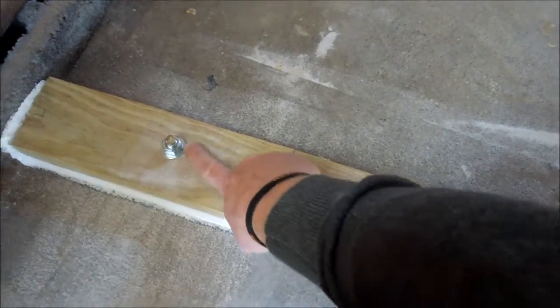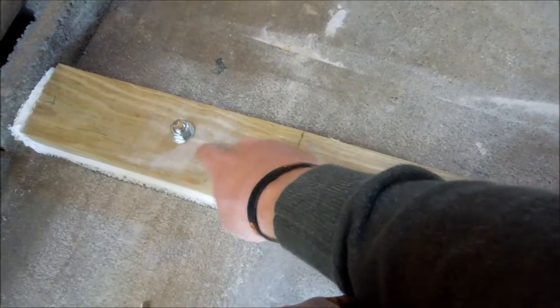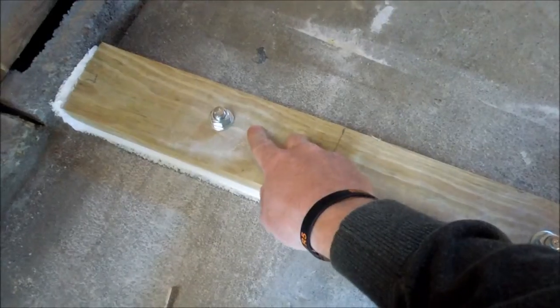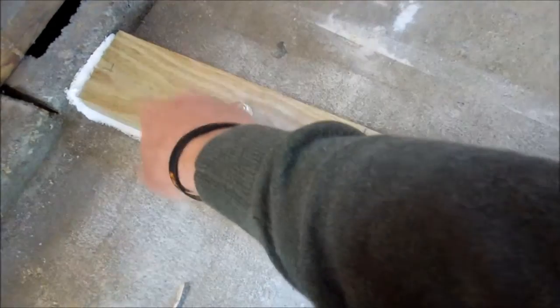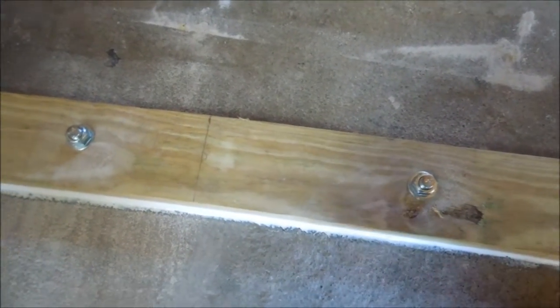And then I've just got 2 wedge anchor bolts. You drill down through the wood and then down into the concrete, and then that goes down there. You can tighten up with an impact driver, and then I've just used liquid nails to kind of seal it off here. A liquid nail underneath, and then I'll go ahead and fill it in with liquid nail on the top, and then I keep water. If any water does blow in, it'll keep it from blowing in into my gun room.